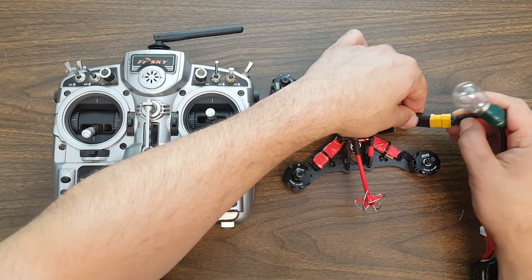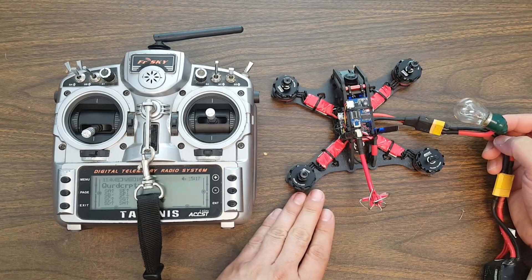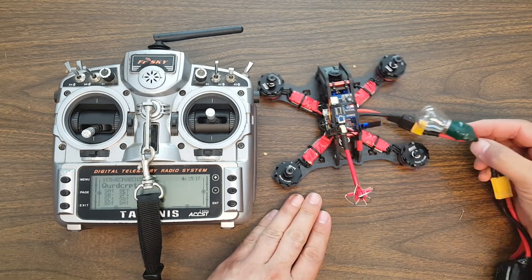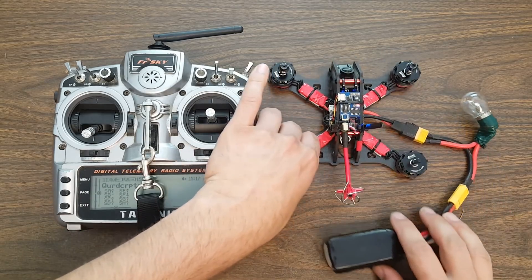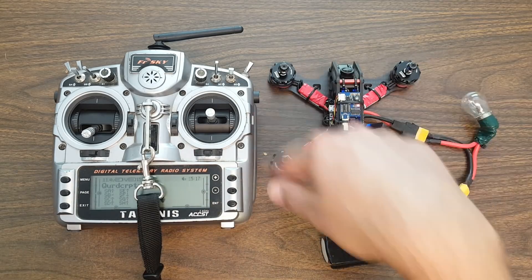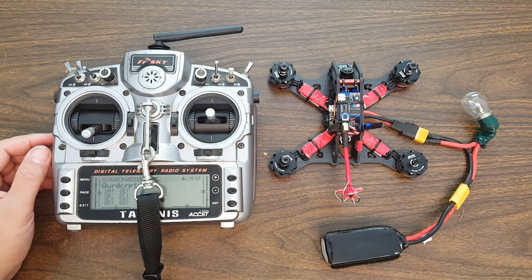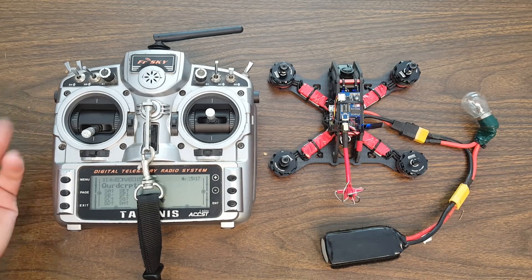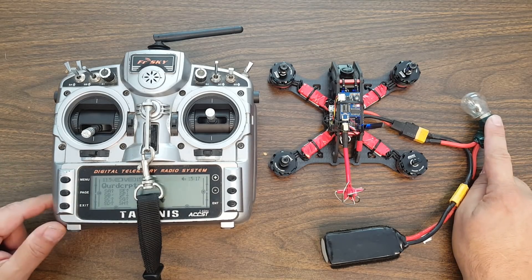So I always do that. Let's plug in — okay, the bulb is not lighting up, that means I do not have a short. Good to know. This is actually all gear I moved over from the QQ190 after I damaged an ESC and motor on the QQ190. So in theory it's all sound, but any major work, always use the smoke stopper on the first plug in.